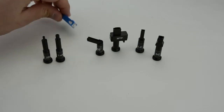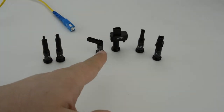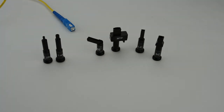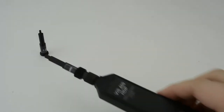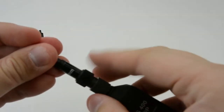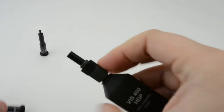These tips are used to inspect fibers inside bulkheads. Due to the variety of connector styles and ferrule sizes in fiber optic installations, it may be necessary to change the inspection tip on the scope. To change adapter tips, hold the tip and spin the attachment ring. To attach a new tip, just place the tip over the end of the scope, hold it in place, and tighten the attachment ring.